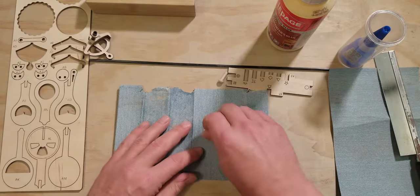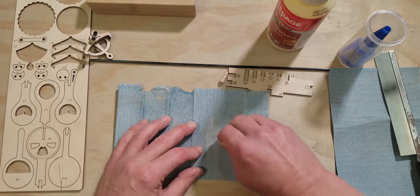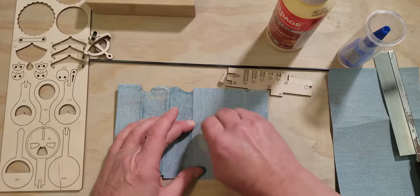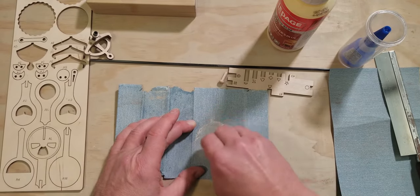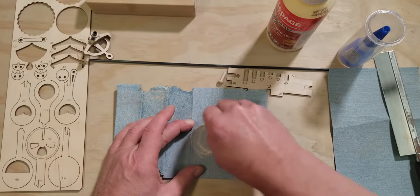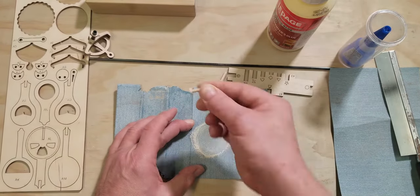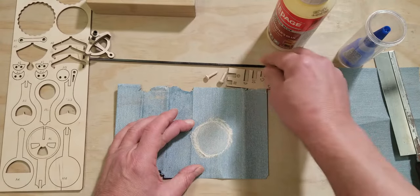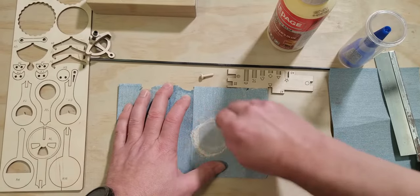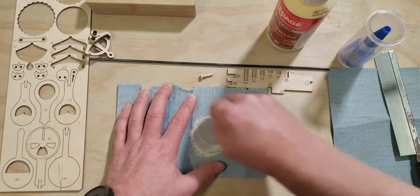These are the ones that connect the pendulum to the pallets, and that's done via a crutch, which is just a short piece. So what we're doing is thinning the heads of the pins to provide clearance between the pin and the clock face, and then we'll trim them to length. Just a piece of sandpaper here. I am using 150 grit to take it down quickly, and the exact thickness isn't critical. Just looking for something about an eighth of an inch, a little bit more, maybe 3/32 or 3/16, something like that.